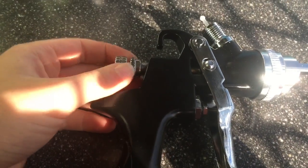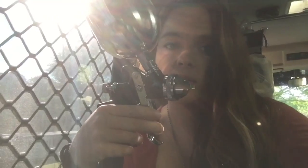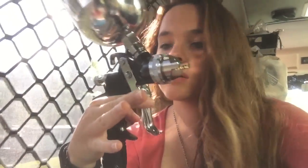On the back here, you've got your different tensions for the needle. So there you have it — the gun assembled and made. It's pretty cool. I do like the cup size on this one; I'll be able to stick heaps of paint in there, so it will involve fewer refills because that can get annoying. It's got a 1.4mm tip on the end too, so I'll get a good wide spray.